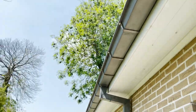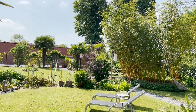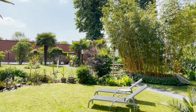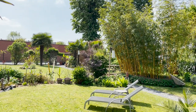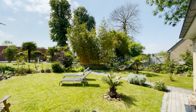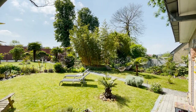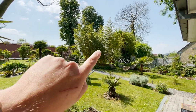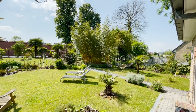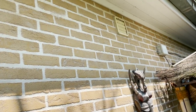Here's a tip I can give you in order to choose the right position. When you have a phone where you can zoom out to 0.5x, you have exactly the view that the camera has as well. So with the camera installed here, I can see my entrance over there and I can also see the entrance of the garden — it's a great view. I think it's the best position for the installation. I will drill the holes right now and then install the box, and at the end wire the camera.